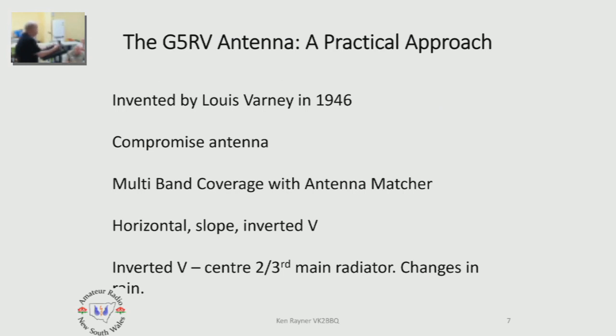It's a manual, but because I'm using usually an FT897, but I also use an IC7000, neither of which have got automatic antenna tuners on them, and they have a maximum output of about 100 watts. Normally I will run under the 100 watts. I'll probably run at about 75, 80 watts. Something like that. This antenna has no problems reaching VK7, VK5, VK4, VK7, ZLs. Has no problems reaching those areas with great clarity on 70, 80 watts.